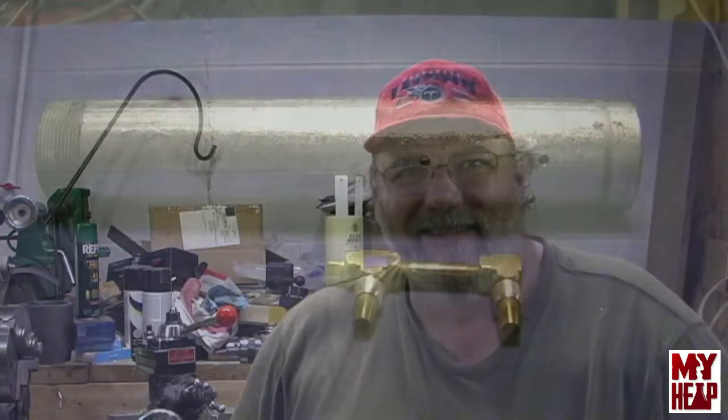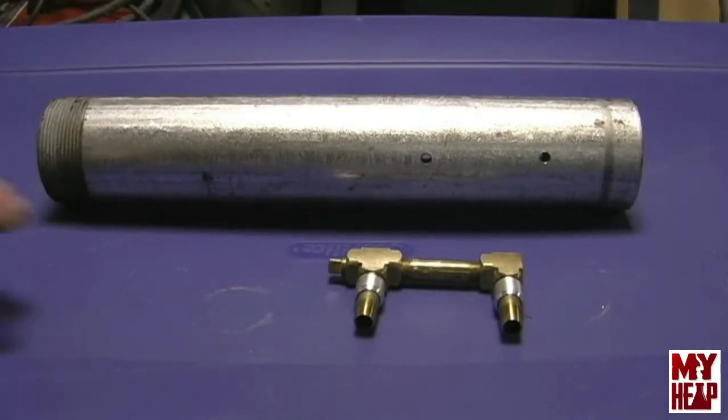In our last video on the burner build, I was testing it on water, trying to adjust it. Since then I've talked to Chirpy, who commented that adjusting it with water will probably be fine if I were going to burn just diesel, but I may have to readjust it for vegetable oil or motor oil because it's a lot more viscous. So let's carry on with the rest of this build and see if we can at least make some fire today. Sound good?